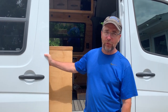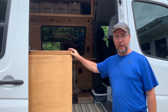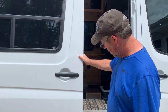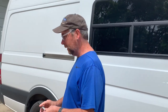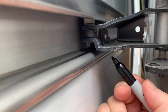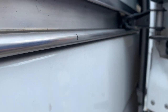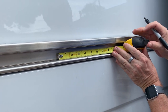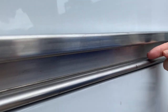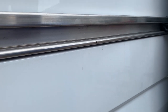The first thing we want to do is figure out where exactly along this track we want the door to stop. In our case we have a countertop and we want the door right even with it. We come back over here and using a Sharpie we mark the location of this roller on the roller track — specifically the center of that roller. Then four inches behind that we put another mark on top of the track, right at the center point where the roller rolls, so we know where to position the roller stopper side to side.